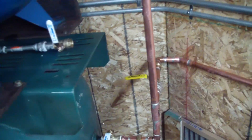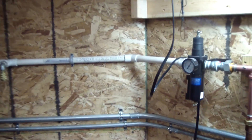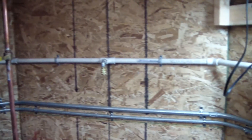I built a manifold system connecting the two tanks and added valves so I can isolate everything. Plenty of unions to make it easy to work on. That's the thick wall copper tubing. In one of my cheap phases I added some schedule 40 PVC — it's rated to 480 psi, but it's definitely not something I would recommend anybody do. I could just picture that turning into a shrapnel grenade one day.